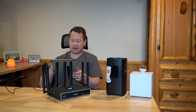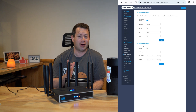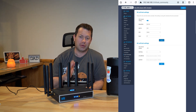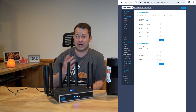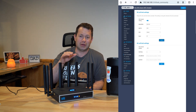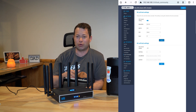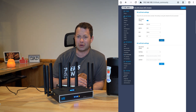I tested several SCS values. I'll be honest — I don't fully understand whether it sets a max or a fixed value. The only one that showed noticeably slower speed in my situation was 15 kHz. The 30, 60, and 120 kHz values all worked and showed very similar speeds. I'd recommend testing it yourself. There's a slight chance that if you pick an incompatible SCS value the modem may crash, but you can just reboot the unit, pick a different value, hit save, and you'll be fine.